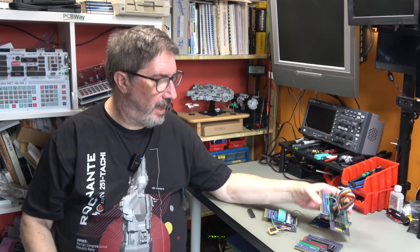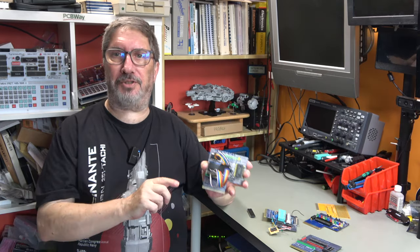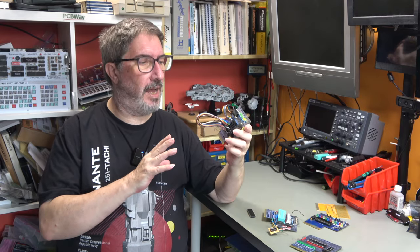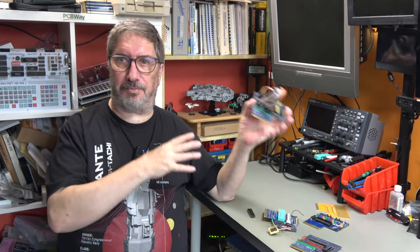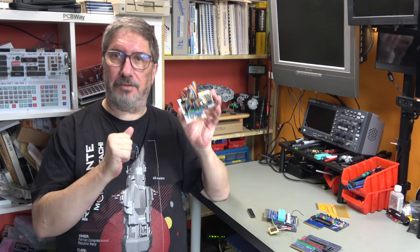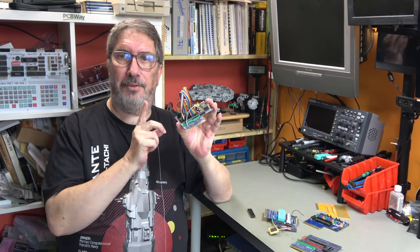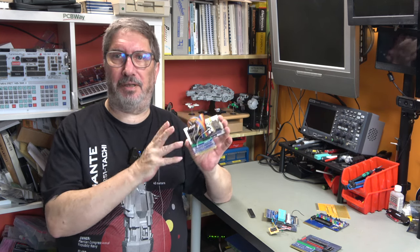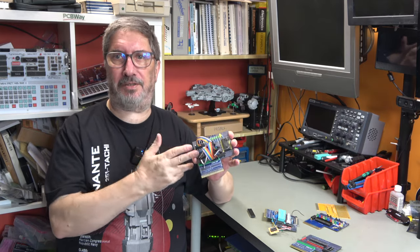And so I went to Discord and a lovely chap there called Andre Fachat, I hope I've said that right, came up with what I think was the reason and also the solution. And the reason is that on the Commodore 64, the VIC-2 chip steals the bus for a certain amount of time and does its video-y things and then gives the bus back for everything else to do their I.O. things, their memory things, and so on. But it is not very clean about it. And consequently, the I.O. chips are sensitive to that bus being in the wrong condition just at the time when it's expecting the data to be valid.